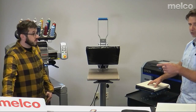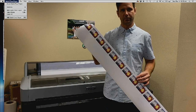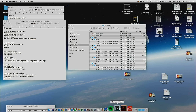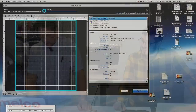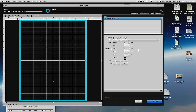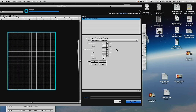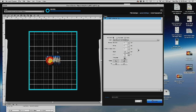If the material is wrinkled or not sitting properly flat on the platen with nothing to hold it in place, that can throw off the sensor. We can always use tape, but what we need to do is tuck this thing in and make sure it's nice and flat — the tuck lock platen lets us do that. You can order these platens if you have an F2100 or F2000 from shopmelco.com — they're outstanding, one of the best platen manufacturers in the industry for direct-to-garment printing. Here's my piece of canvas on the 10 by 12 platen. Now I'm going to show you in Garment Creator how we set this up.